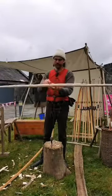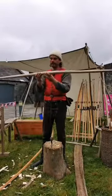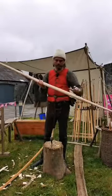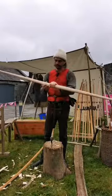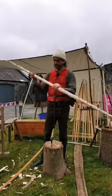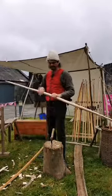I've been able to position the larger knot in the center, where there's almost no bend — both limbs are doing all the work. This will be a full compass bow, which means it bends all the way through the whole length, as opposed to a target bow which has a riser that doesn't bend — but that's a more modern style of longbow making.